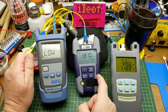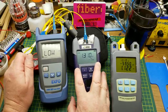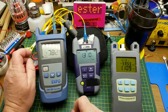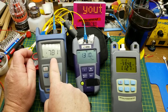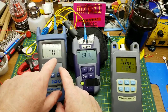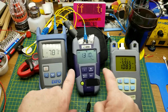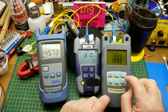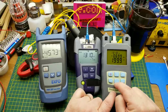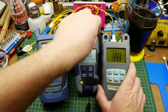Here we are set up. The light source is set to minus 7 dBm — that's where we normally leave it so we don't accidentally blow anything up by overpowering a connector or an SFP. It came up at 1310nm; this meter is also sitting at 1310. When I turn the light source on, I'm transmitting at minus 7 and receiving at minus 7.81 — so through these connectors and the loopback I'm losing 0.8 dB, but that doesn't matter. What matters is: does this cheap meter see the same level as the EXFO? It's reading minus 6.99 dBm — a little bit higher than the EXFO. Plus or minus 0.2 dB, it's a little bit off, but not horrible.